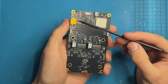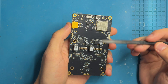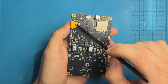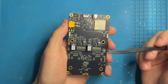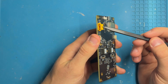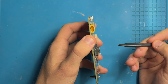Some of you will say that's not a real connector — it's from the RC world. And yes, this connector is used in RC cars, RC planes and so on, but it is rated for really, really high amperages and it does a perfect job. It's also used in a couple of industry standards. We decided to ditch the barrel connector because it's just not rated for what we want to achieve. We switched over to the XT connector, which — because it's flat on one side and angled on the top — prevents you from inserting it the wrong way around. So you cannot fry the device.